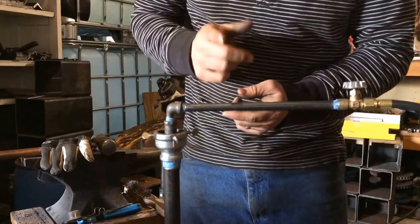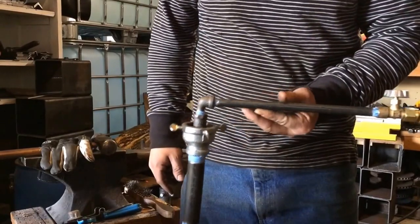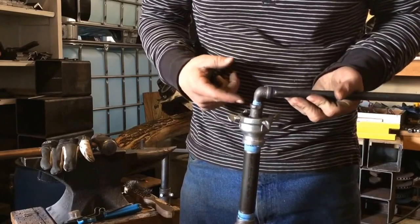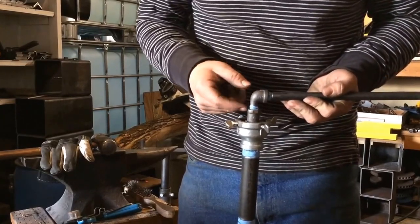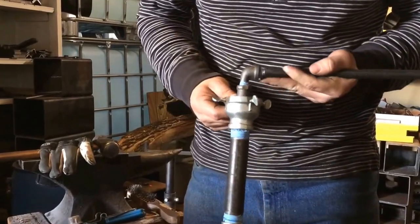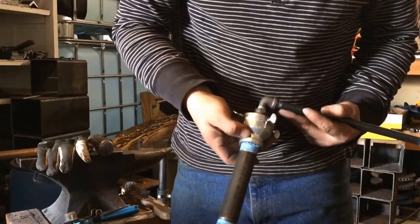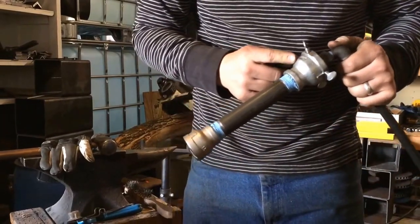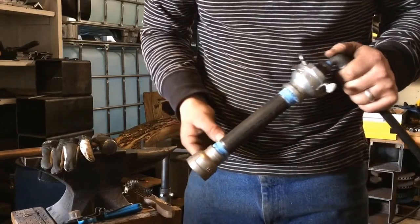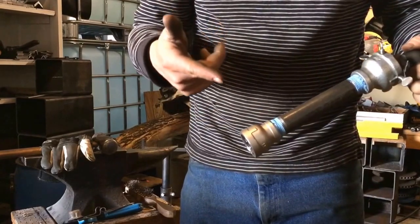Just to go through this again: this is a 12-inch long by quarter-inch pipe nipple right here. This is a quarter-inch street elbow and quarter-inch coupling — you could actually just combine those two and get a quarter-inch 90-degree elbow. And then this is a quarter-inch brass plug. One-and-a-quarter by three-quarter galvanized reducing coupling. Three-quarter-inch pipe nipple, six inches long. And then there's a stainless steel one-inch by three-quarter-inch reducing coupling.